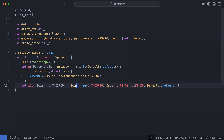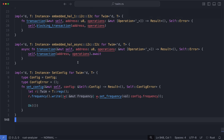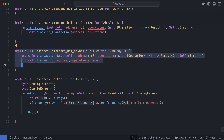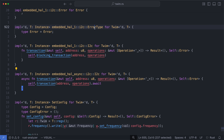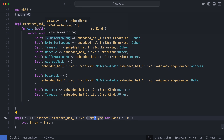If we take a quick peek into this HAL, we can verify that it does actually implement the I2C trait for the async embedded HAL, and also the error type super trait, making the HAL's error enum an associated type, which in turn implements the I2C error trait to provide a conversion to the more general kinds defined in the embedded HAL. Okay, we've got a HAL that implements the I2C trait — now we need a driver for our sensor.